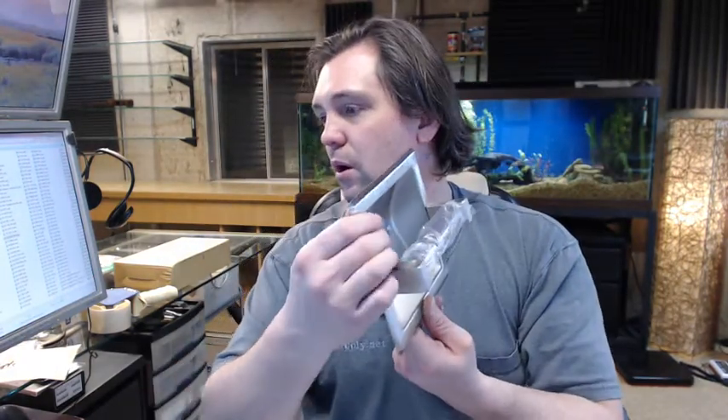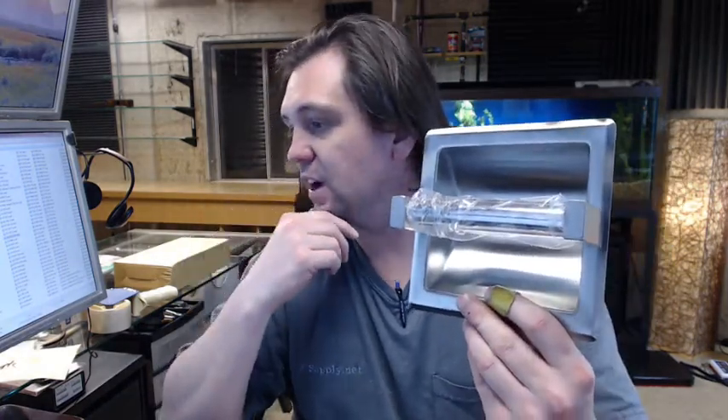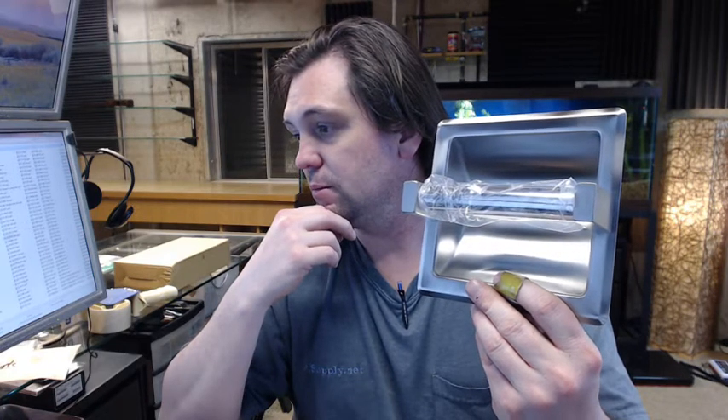Be sure to consult your mounting height for ADA compliance. There is a reference to that in the cut sheet. Center line of the roller: 19 inch minimum above finished floor. For compliance with ADA accessibility guidelines, the unit should be installed with center line of roller 19 inches AFF to 44 inches max AFF. And forward edge of the roll no farther than 36 inches max from the rear wall behind the commode — you don't want to have to reach over too far.